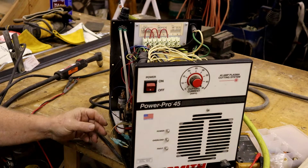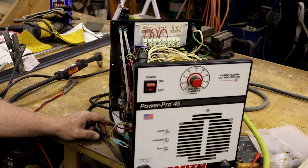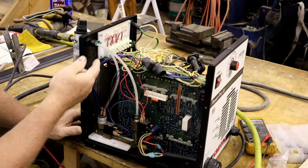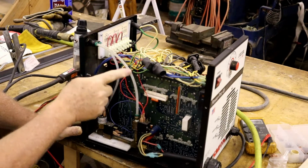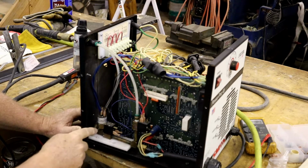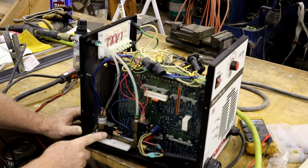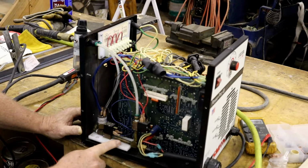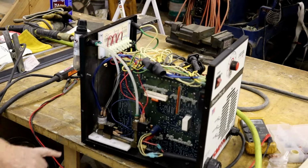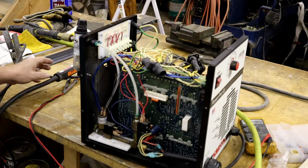One of these two lines here tells it that there's pressure. It actually has two lines at a Y right here. One comes over here and then goes down to a T. The other comes around and then comes in to this solenoid and I guess a pressure sensor. Wondering why they have to have two of those. This one doesn't have a way to control the air, so it should be going all the time. There should be maybe some air coming through.